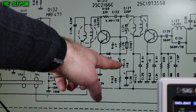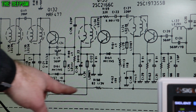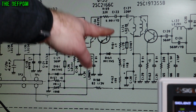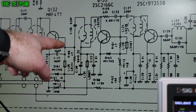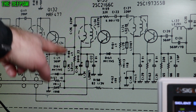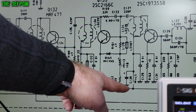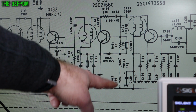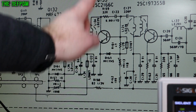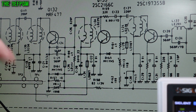There's a driver bias over here. What's happening is the DC bias from this was leaking back through this bias circuitry and pulling this one up. Right, it's actually pulling this whole thing upwards, because this is a 13.8 volt supply leaking through, and this is an 8 volt rail, which actually comes out being about 7 volts in the end by the time it goes through the switching transistor. So about 7 volts coming through this rail, which should be feeding this biasing, and because this was pulling it upwards in voltage, it was messing up the biasing a whole lot. So that's what was happening there.